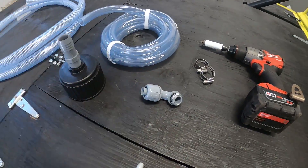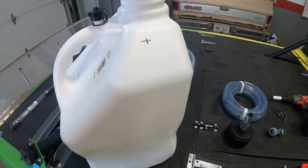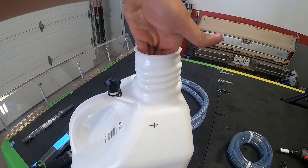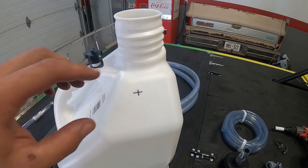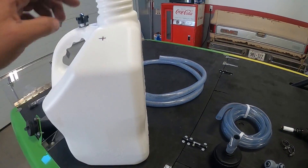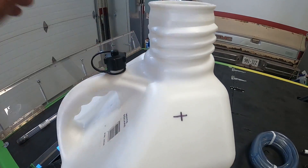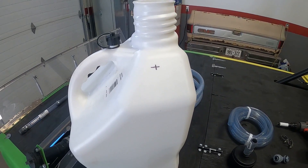What I did next was mark the can right here for a spot for the vent. We're gonna drill a hole to mount that liquid-tight fitting. It needs to be in a spot where you can reach in to thread on the lock ring — you might need someone with smaller hands than me. If you put it way down at the bottom you'll never get your hand in there. Up here should be perfectly fine — it's not really any different in height from the factory vent.